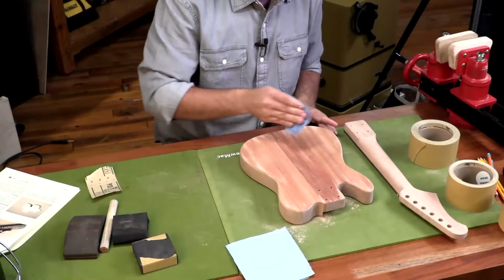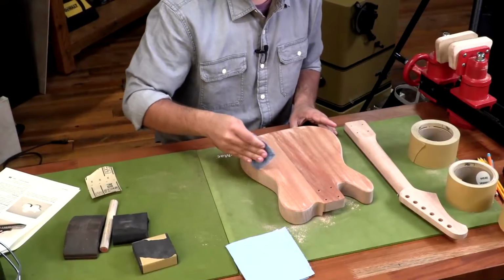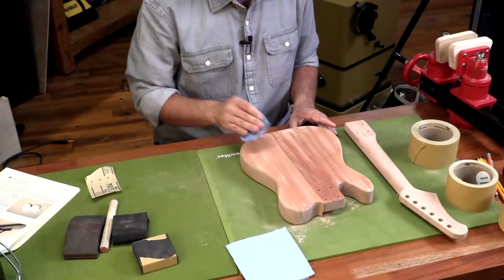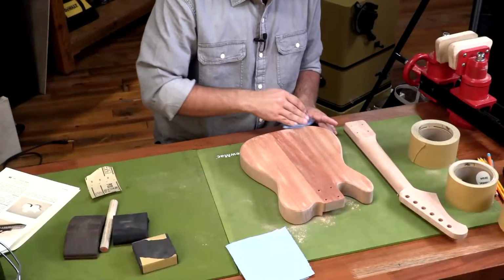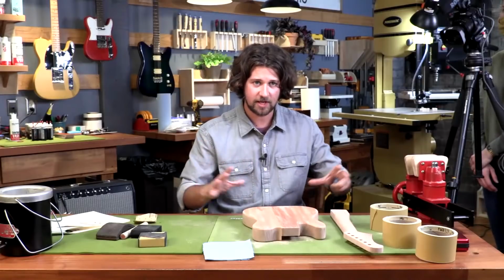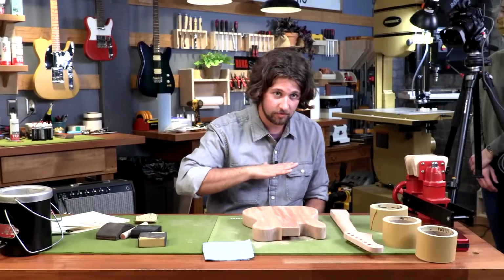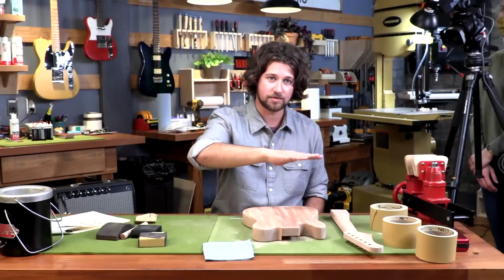Yeah, so what's the big benefit of raising the grain? Is it going to help make the finish look smoother or feel smoother, or is it going to help to have the grain filler take? Yeah, well, kind of all the above. It helps you get through your grits a little bit faster. It really helps you get those scratches that are deep down in there that are hard to see, helps them expand out and be the same level as the rest of the wood. Come back through with a lighter grit and you knock those guys right off.